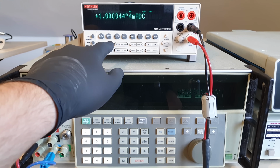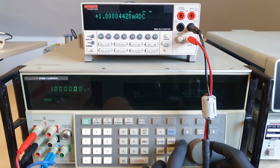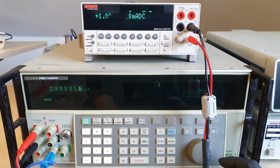Well, the two champions don't agree perfectly, and that's no surprise after such extensive repairs and renovations. But I'm getting similar results, which is the most important part here. I can now use the rotary encoder to fine adjust the output and show how far apart the two devices are. Approximately 0.0044% in this case. That's 44 ppm, very unseemly under normal circumstances.